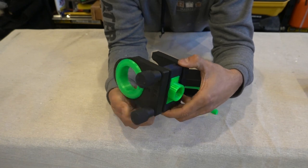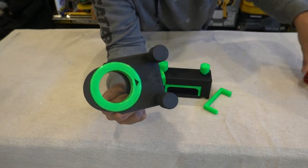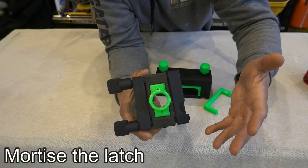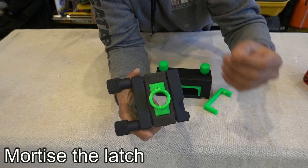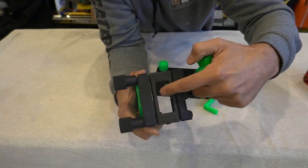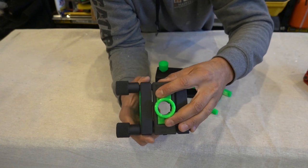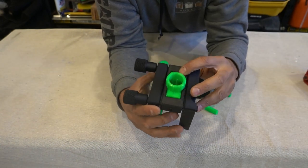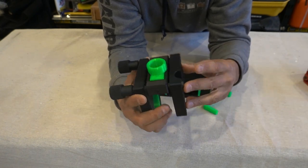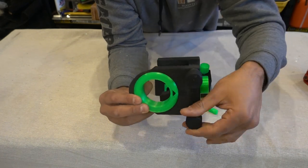Let's have a quick look at our door jig first. It looks pretty standard, very similar to the Milwaukee jig I've been using for years. The biggest game changer here is the ability to bore out our latch location — where the latch recesses into the actual door — by simply popping out the little insert and routering that section out. That's going to save a lot of time rather than having to chisel it or freehand the router.